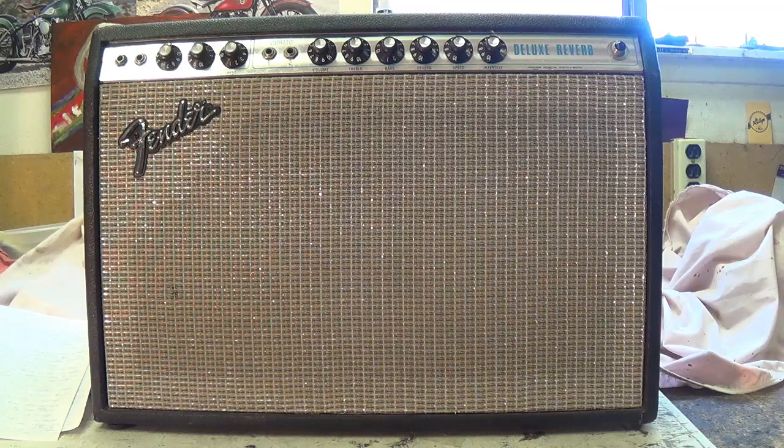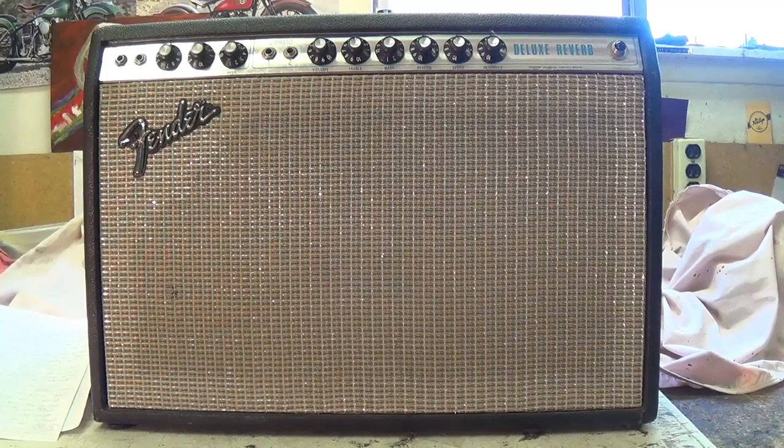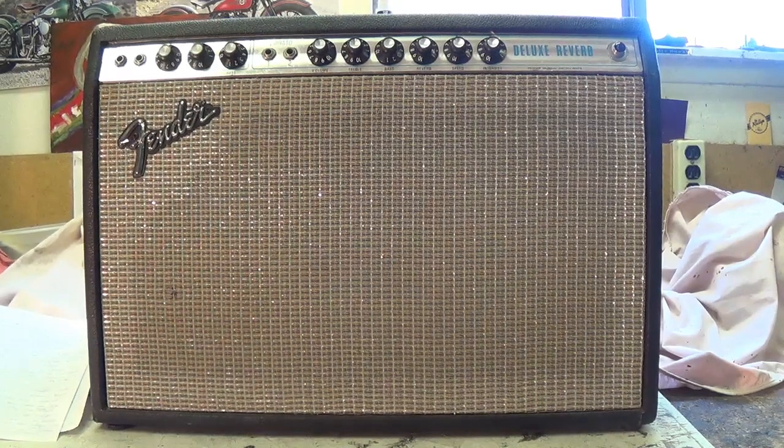But, like I said, at 60% your tubes will last longer. So it's up to you. It's sort of a financial decision versus an artistry decision, okay, as to do with the tone that you want from your amp. And I hope that the data in this experiment was collected and explained in a manner that is easy to comprehend and that you can use to successfully draw your own conclusions. If so, then it's been a great success.